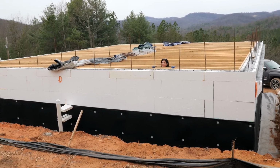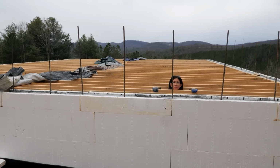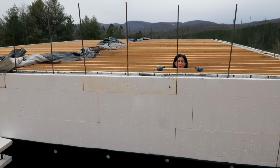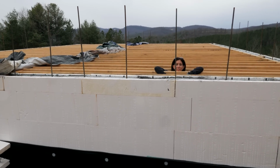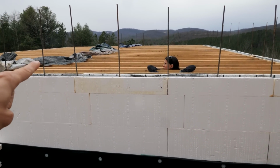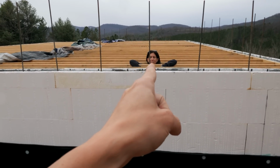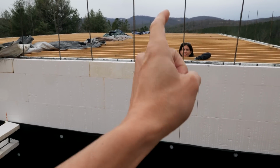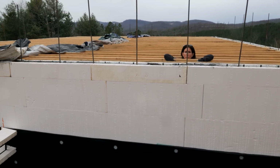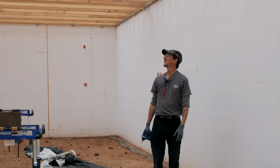Seriously? Hi. I'm supposed to talk about putting in a plumb line. So he made me climb this ladder, poke my head up through the joists to talk about putting in a plumb line. Now, what we've got to do is measure halfway from the beam to the ledger. Find the halfway point, which is right where you're at. Mark it on each end and snap a chalk line. You should have climbed up the ladder and poked your head through the joist. I know, but it looks neat when you do it.